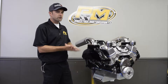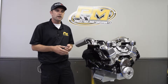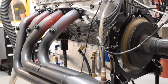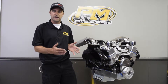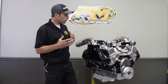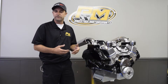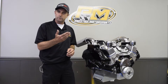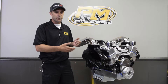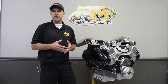Before we discuss options moving up, in previous videos you've seen we developed a 10-quart system for our big blocks. Oil temperature is critical — if a guy isn't running an oil cooler, more capacity in the pan keeps temperatures down and keeps oil around the sump. We'll also get into spring oilers — a separator plate or custom valve cover that showers the valve springs with oil, plus a block modification to squirt oil on the bottom of the piston. That creates more internal oil flow, depleting the sump amount, so the oil pan's importance cannot be overlooked.